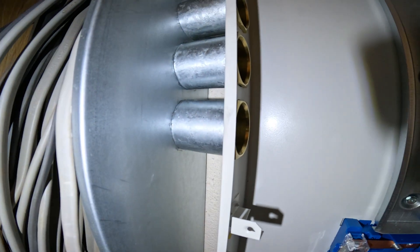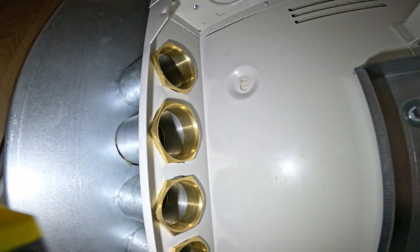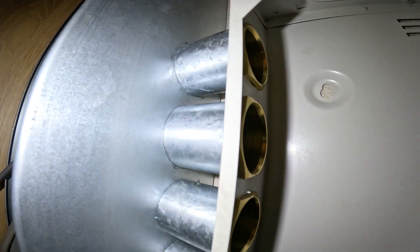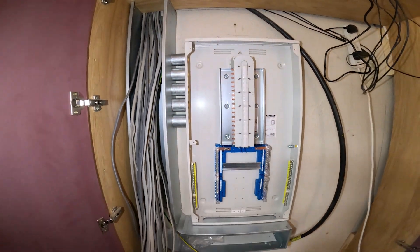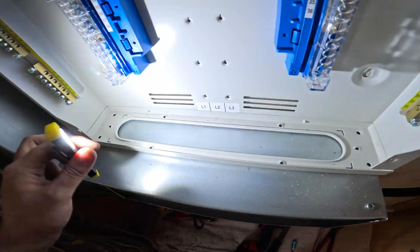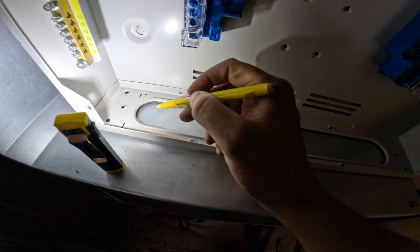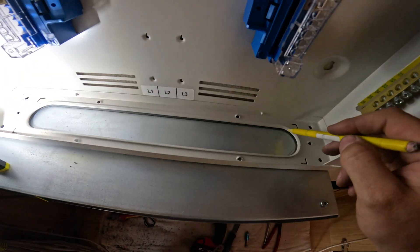So that's coming together nicely now. What we're doing is lining these up - because we've done a 52mm hole there's a bit of play, so we're just going to loosen this off and get that lined up. See there was a gap there, now that gap's disappeared - they're looking pretty sweet. So next I'm just going to get a pencil and mark around this. If we get a hole saw this big, we can cut a hole saw here, hole saw there, angle grind between, and end up with a perfect little slot.